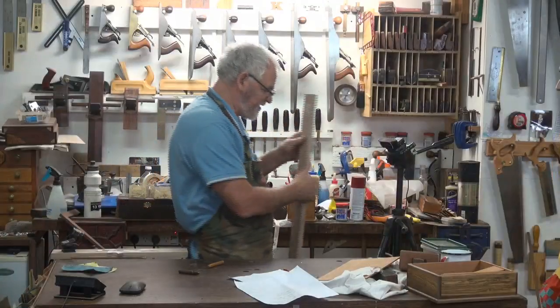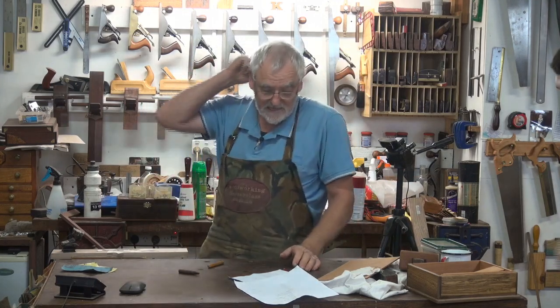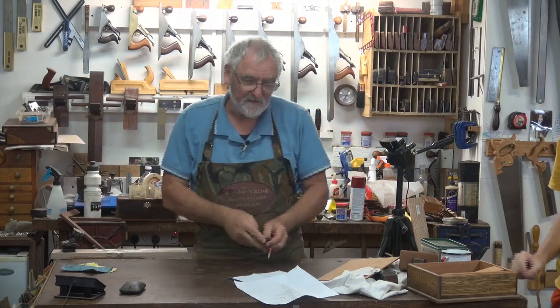I think it depends what sort of a finish, how deep you want it. If you're using Finnish oil or Danish oil, it takes a long time to build up and you get a really nice soft patina on it. Tung oil, as Captain Ken said, takes a long time to dry, but it also gives you a thicker film, very similar to boiled linseed oil.